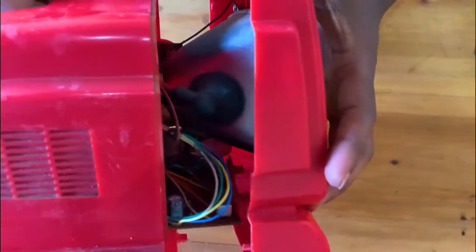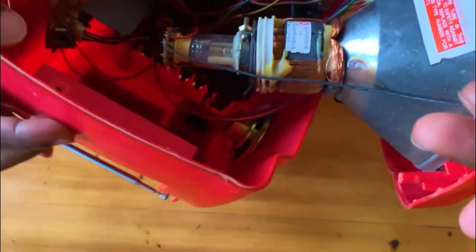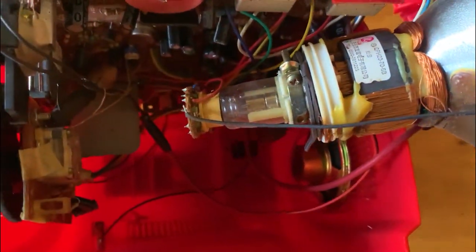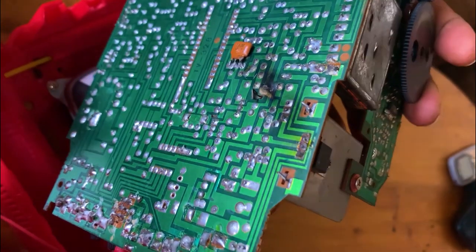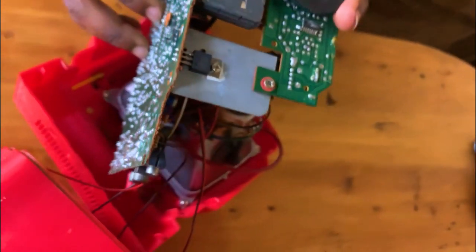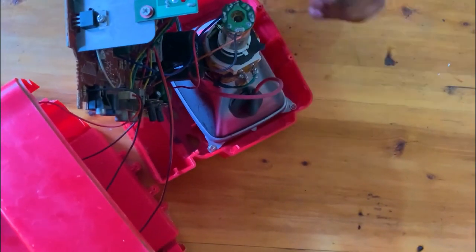In CRT television sets and computer monitors, the entire front area of the tube is scanned repeatedly and systematically in a fixed pattern called a raster. In color devices, an image is produced by controlling the intensity of each of the three electron beams, one for each additive primary color, red, green, and blue, with a video signal as a reference.